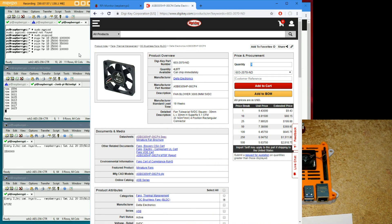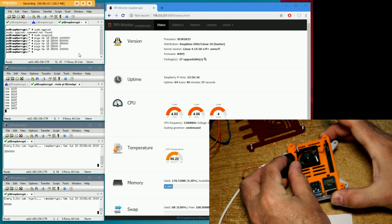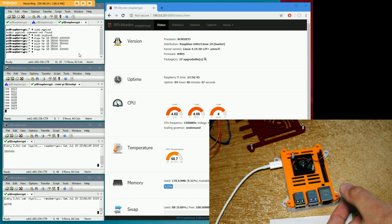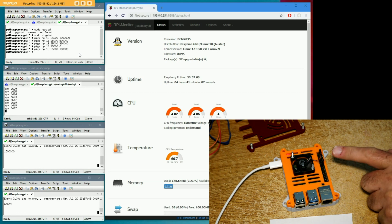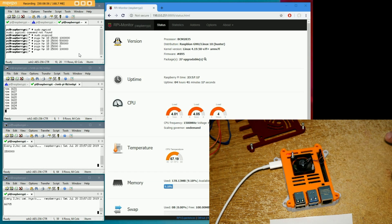This Delta fan is my preferred fan. I'm going to use it in any projects where I'm at all concerned about temperature — I'll probably use it on the OctoPi that goes on my 3D printer, since it's a little bit warm over there already. The things I like about this fan: first of all, it is only 7 millimeters thick, compared to the 10 millimeter Sunon. 7 millimeters thick means that if I had a normal full case I could easily squeeze that fan inside. You've also got the PWM which lets you easily control the fan speed, and you have RPM feedback which lets you measure the RPM. The disadvantage is that to use the PWM or the RPM you do tie up a couple of GPIOs. The other thing about this fan is it has very thin wires — these were actually a little bit hard for me to crimp. I had to both crimp and solder because the DuPont terminals I crimped into, the wires were so small that they would kind of pull out.